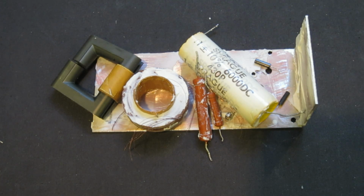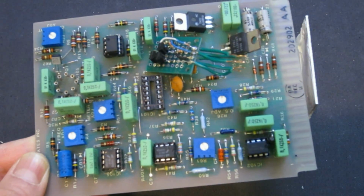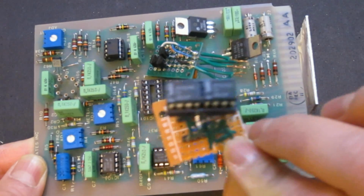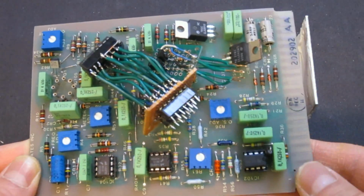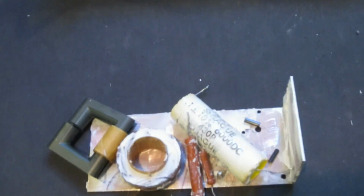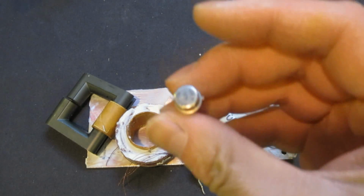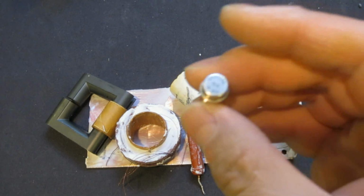After I resocketed the boards, put this Cascode amplifier on, and put on this ad hoc TL083 made of two TL081s, everything seemed to be working fine. But as soon as I turned on the power of that power supply, the pass transistors got extremely hot. If you recall last time, there was actually some oscillation. You can see that on the input into this op amp, into this Cascode amplifier.